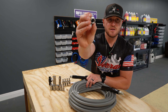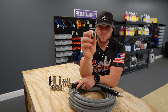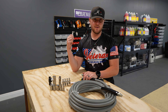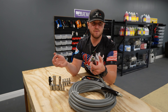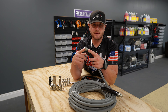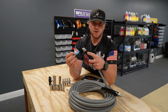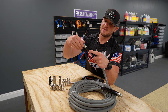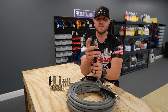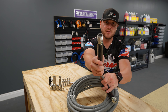What you're going to need is a stainless steel reducer, just like this one right here. All it is is a half-inch OD and then there's a three-eighths ID inside of there. So you're going to take the three-eighths side — and obviously you're going to Teflon everything that we're about to talk about in this video. I'm just not going to Teflon it because this is stuff I have pulled off the shelf that we still have for sale in the store. But I am going to show you how to go from the end of your hose after you get it on your hose reel to the point where you're able to make those different attachments. To go into your hose reel, you're going to take this three-eighths ID side of this reducer and screw it onto your pressure hose, and then all you're going to do is screw this half-inch side into the half-inch connection on the actual hose reel itself.